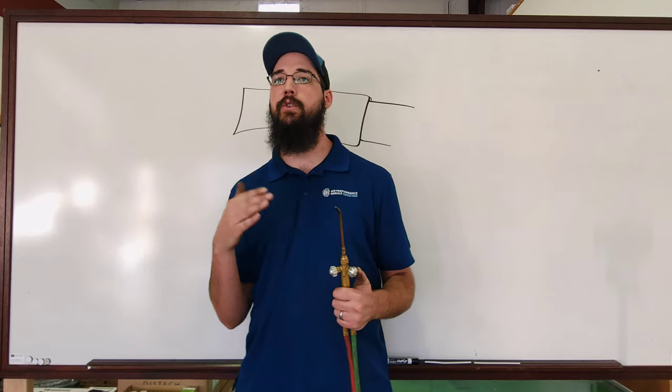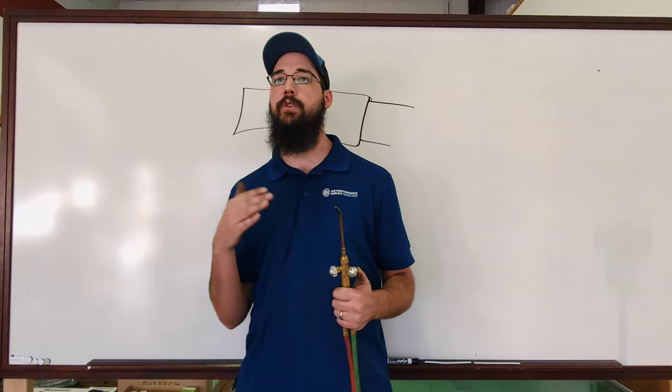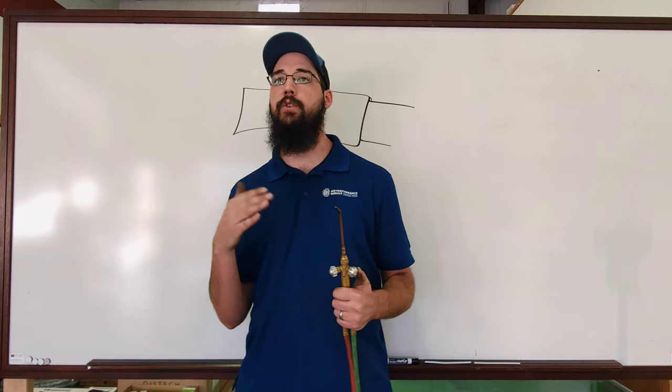This is about the heat you would use on aluminum — maybe even a little bit less. Now if you're doing some larger copper, we're going to step up the acetylene first, stretch that out, and then pull in the oxygen. That's going to be a lot hotter flame — this is what you might use to anneal with. And if you were doing really big copper, you're going to be cranking this up, but that's about the maximum you're going to get out of it.